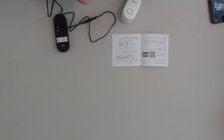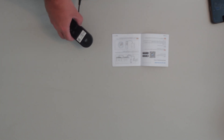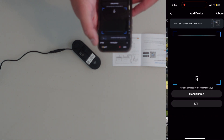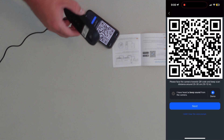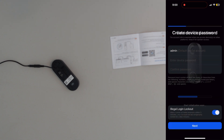We need to connect the video doorbell before the install to make sure everything's working. I went ahead and connected the two wires on the back, and I'll plug in the chime as well as the doorbell, then add it to the app. As soon as you plug it in, it tells you to install the app in multiple languages. Loading the app, selecting add, and then scanning the QR code on the back of the camera — you use the doorbell's camera to scan the QR code your phone creates. Once it says connected, you hit next.